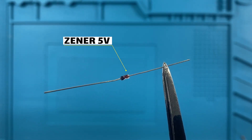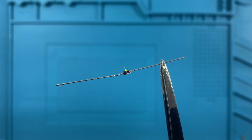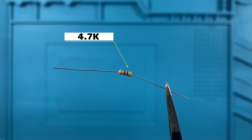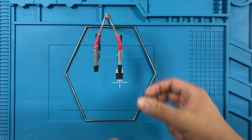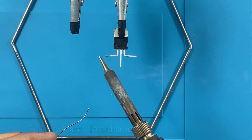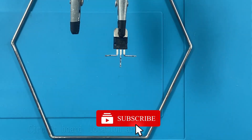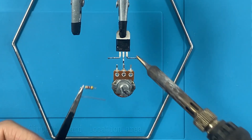To build this circuit, you will need the following components: a TO220 package transistor such as the IRFZ44N, or any suitable MOSFET that can handle the required power; a potentiometer, preferably a 10k ohm linear type, which will act as the brightness control; a 1k ohm resistor to limit the current going into the transistor gate; a small diode like the 1N4148 to prevent reverse voltage; some wires for connections; and an LED strip to test the circuit.